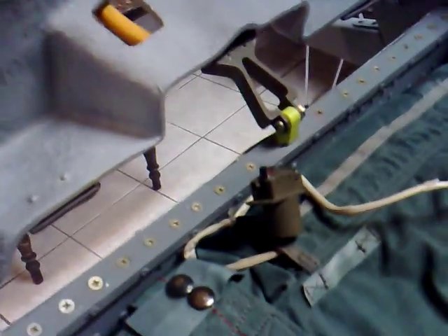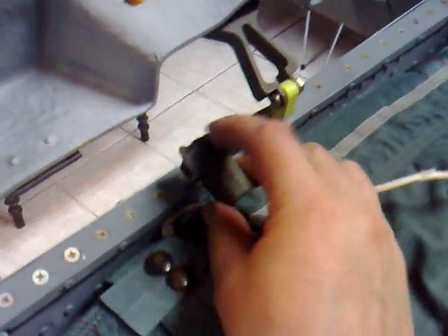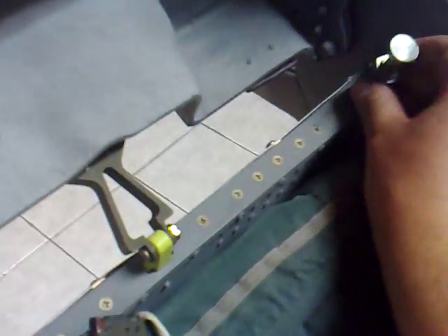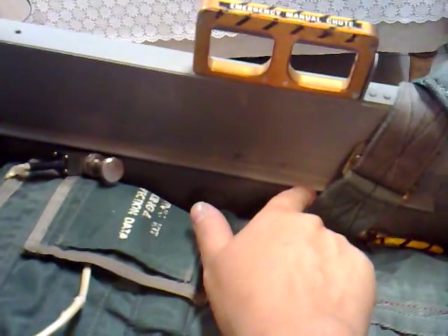There are two little loops to open up the seat pan. This is the inside — the seat pan was made by Earl. It's the masterpiece of the seat; I upgraded it a little bit to give it a more realistic look. There's still a little bit of work to be done on the inside, for instance mounting a switch with a plate. The seat support rails are riveted like the real one. The back rail is pop-riveted and reinforced from the inside, so it can hold a lot of weight and handle a lot of abuse.